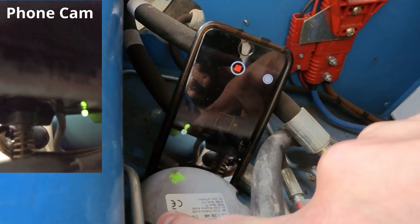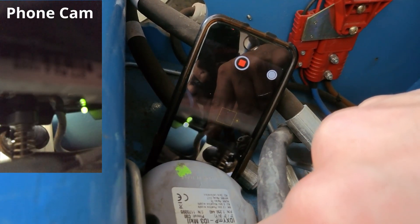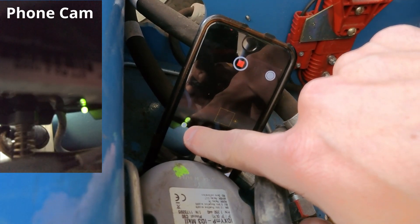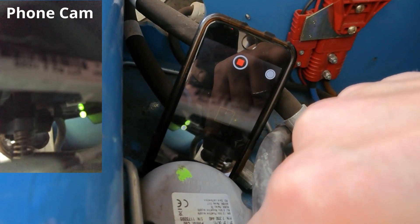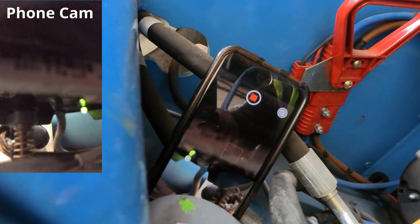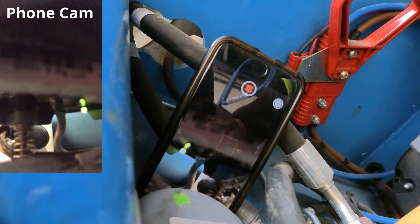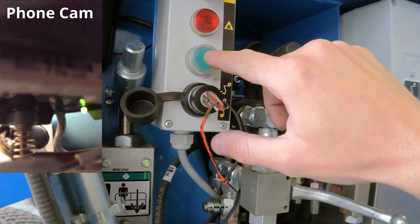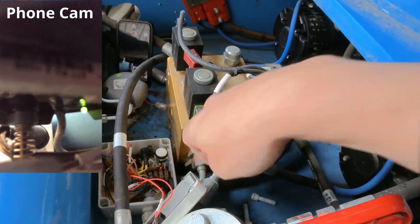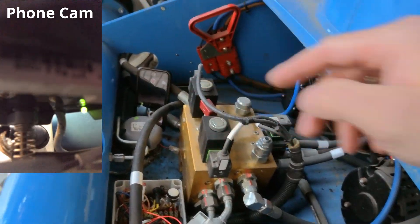Now the calibration is done. When the sensor goes off the angle, the LED will go off — see the LED switched off and came back on. I can see the LED flashing right here. I'll do one more time: push the green button, and while holding that button, press the white button and hold it for about seven seconds. Once I release that button, that LED will flash.